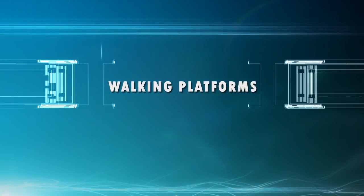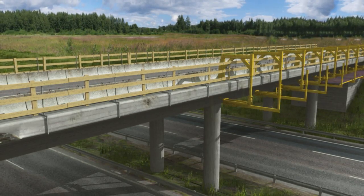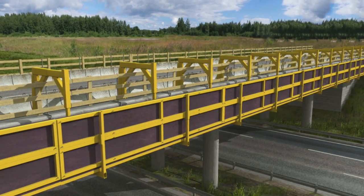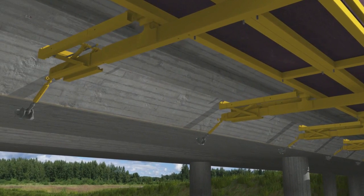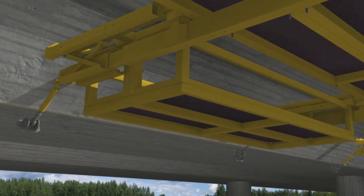After this, the walking platforms are raised. The work stage proceeds hand-in-hand with the installation of the railing, so that a rail is always put in place after a part of the platform is installed. Parallel installation platforms will be next, and they will be placed on the forks of two successive trestles.